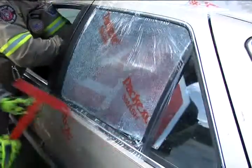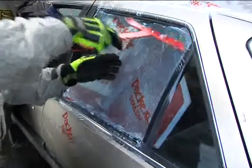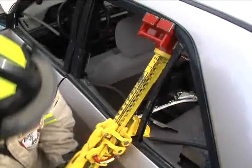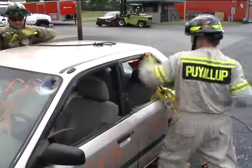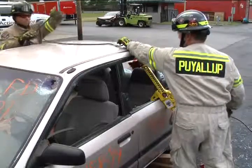Next, remove the glass from the vehicle, then strip the interior of the upper B-post, exposing any hazards. With the reversing latch in the up position, place the first responder jack in the rear 1/3 of the door frame of the rear door window. Now, place the base of the jack, capturing the roof rail. Once this is completed, place the large runner onto the door sill and tension the jack.